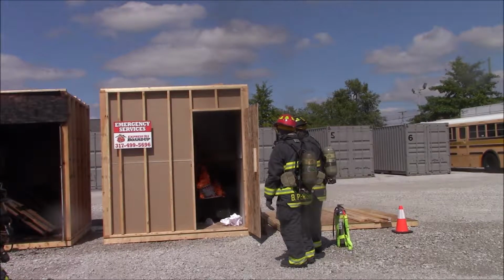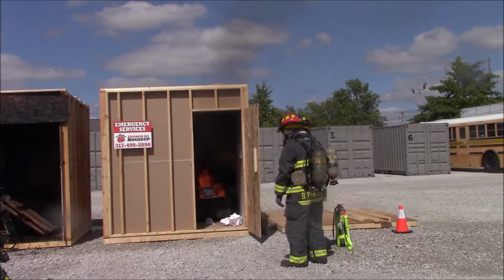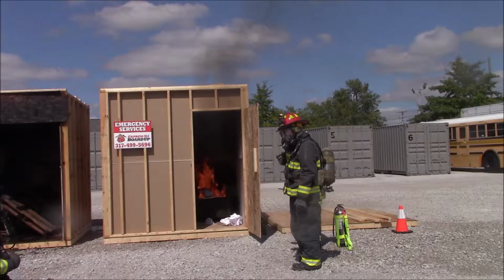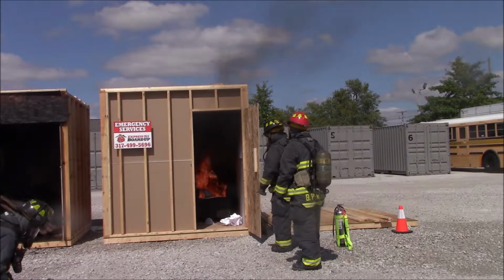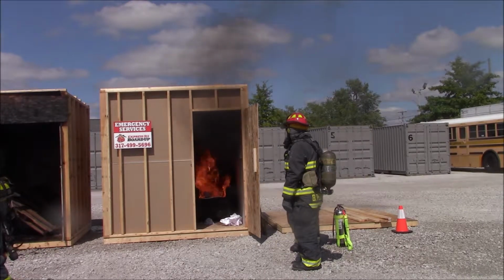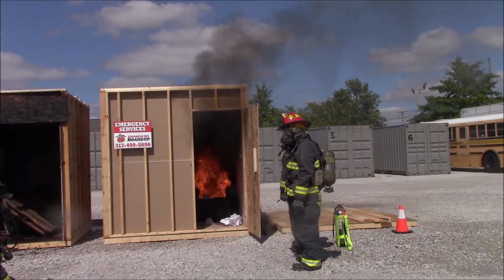Our energy is going into the drywall, heating up that environment. And this stage of fire growth is nice and slow. It is a much smaller opening, so we'll keep more heat energy into those walls, but we do have enough opening to support about 4 megawatts of heat release rate. Should be plenty to flash over that small room.